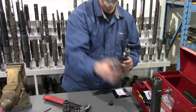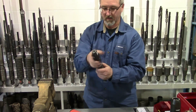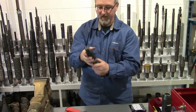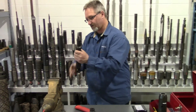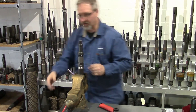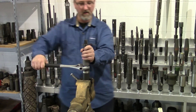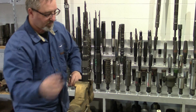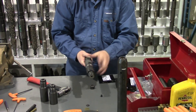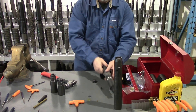Then we can install our firing pin housing. At this point, I like to tighten these two subs together. Screw up my safety sleeve a little bit to allow room for my crescent wrench to fit in there. Now we'll leave the safety sleeve down, making contact, in case the tool is dropped — there's no chance of the shear pin getting shattered prematurely.